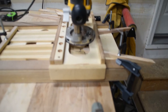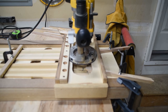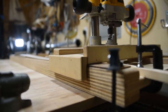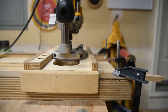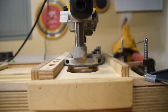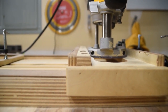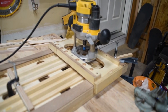The sled here is very simple. It's just got a little lip that hangs over the edge on both sides. It's also got a little wall for the router to run into. I cut this little custom-sized piece of wood right there to make sure to have a pretty snug fit with the router — not too snug. You don't want it to be dragging, but you do want it to not be too loose. And yeah, it's just kind of the leftover piece of wood after the whole construction.